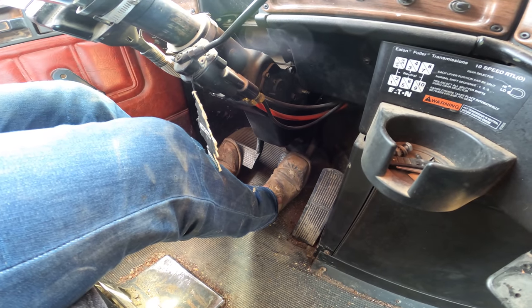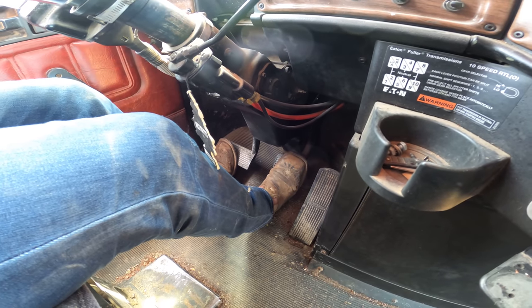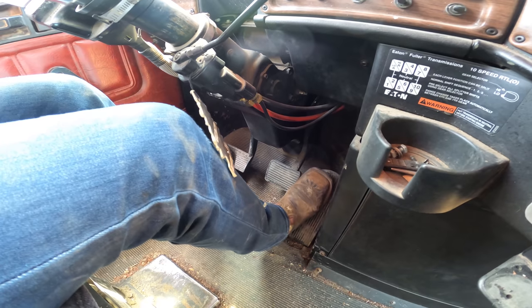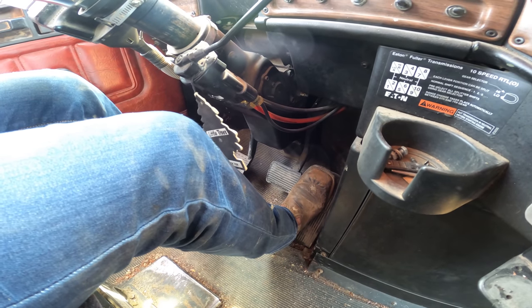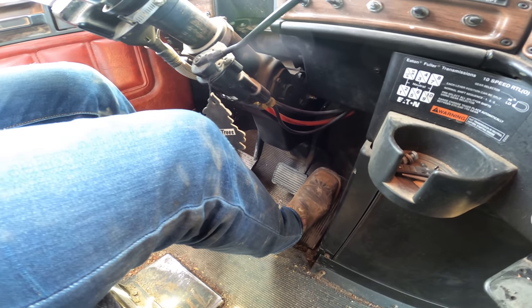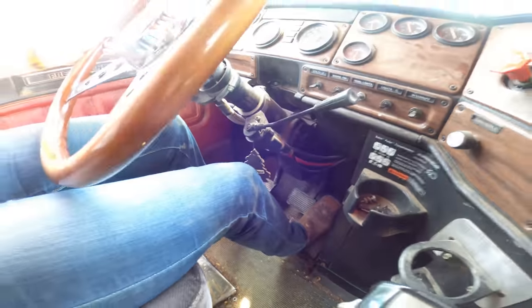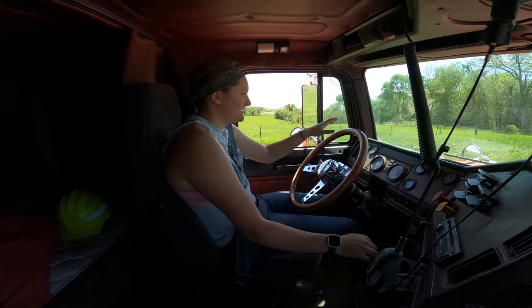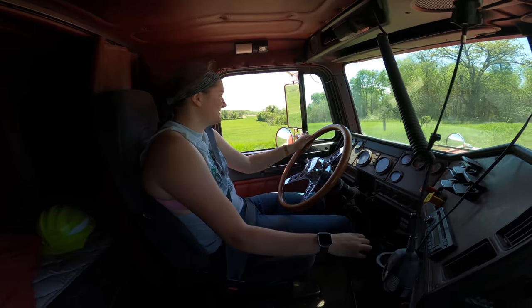You feel the motor start to pull right there. Now release the brake. Keep releasing the clutch, and move your foot over to the accelerator and start giving the gas. There you go. Just like that. Perfect. You're a professional. Oh, absolutely not. Or a natural, something.